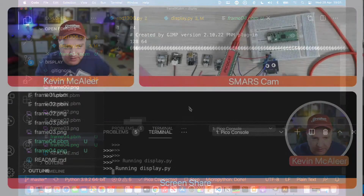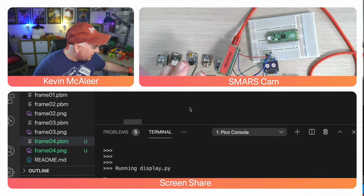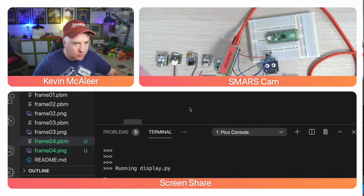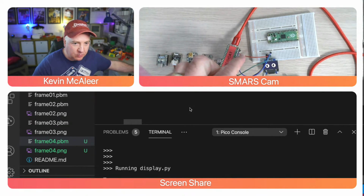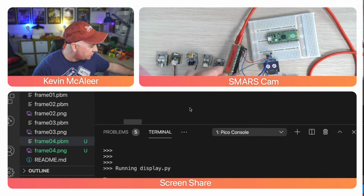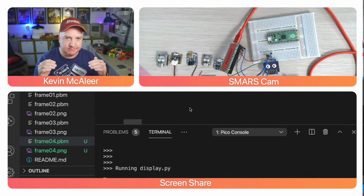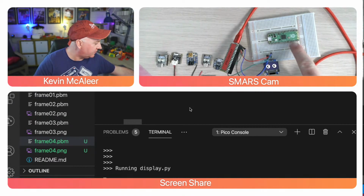So what I've got going on, I've got this one that says Pico Cat on it, a Raspberry Pi Pico that's just wired into my Mac, and I have a little display which has just been plugged into the I2C bus, and I'm just using pin 0 and pin 1 on the Raspberry Pi there, you can just see. I've chosen to use some header pins that can receive jumper wires or DuPont cables rather than having it in a breadboard, but I could use the one that's on the breadboard there.